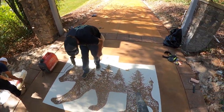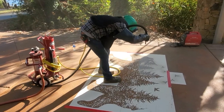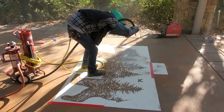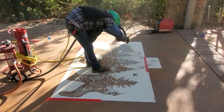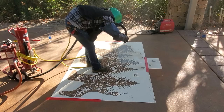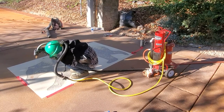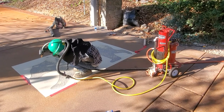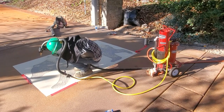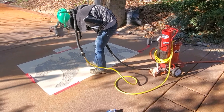This is a heat gun and we went through trying to heat the adhesive up so it would stick a little better right before the sandblast guy came in and started etching the color off. This was already acid stained and acetone dyed when we put the stencil down. What he's doing is etching the color off and down into the cement paste a little bit more.